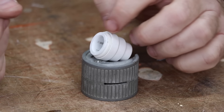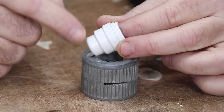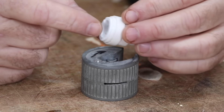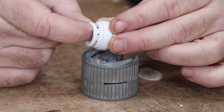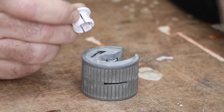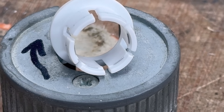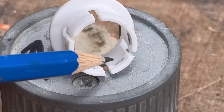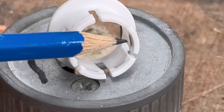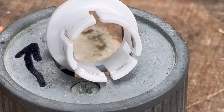The plastic push-on stop end is made out of a couple of pieces. The main body is all one section with a couple of gaskets to create a seal around your plastic or copper pipe. There's also a wobbly piece of plastic that actually does the job - you can pull it out. The thing that really does the work is these little metal knives that stick out around the perimeter and actually dig into the pipe, whether plastic or copper, enough to stop it pulling out when under pressure.